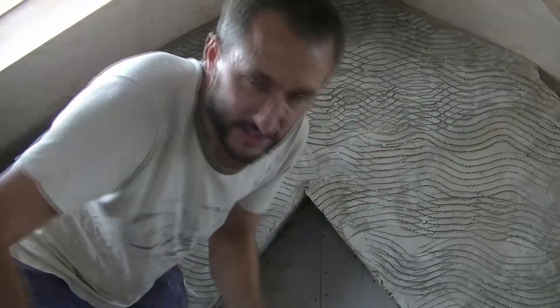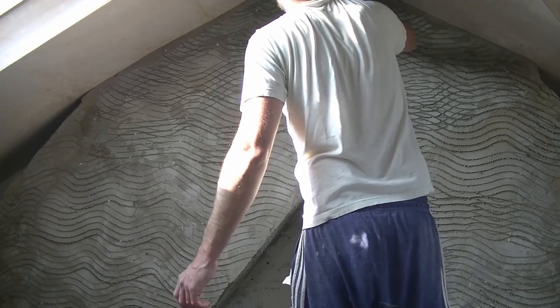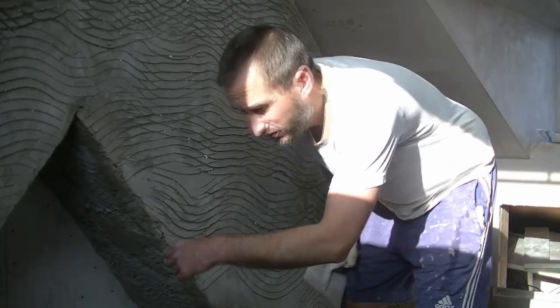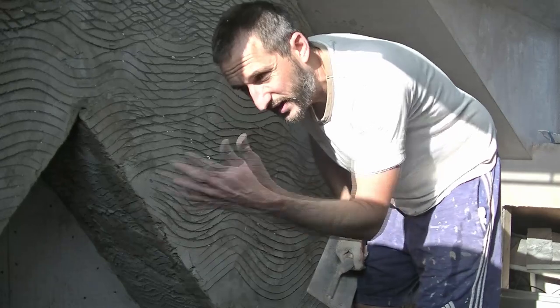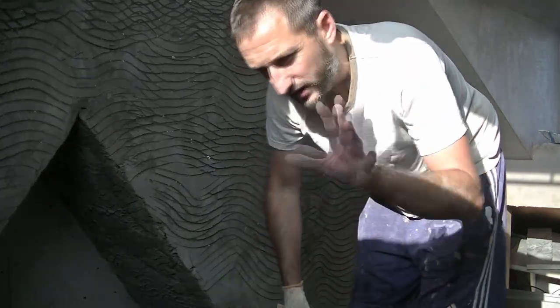And it's a good idea to keep your mortar mix out of the way. I almost got all the loose bits in it then. This bit here that I did previously, I haven't done it to that either, so make sure you get all the bumps off all the sides of the wall you're rendering. You don't want to get halfway through, stick a blob on, then you find you haven't done it and you get all the bits in your mortar, then it can mess it all up.